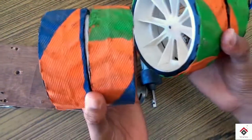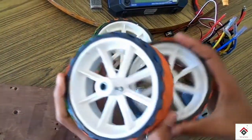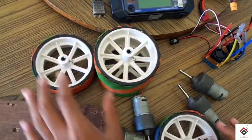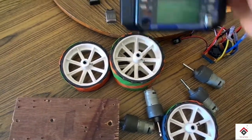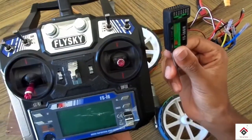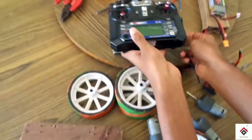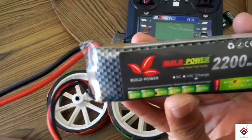For the wheels, we are using 10x4 cm plastic wheels, but if you want to participate in more off-roading challenges, just use RC car tire wheels. We'll also provide that link in the description. We are using a Flysky transmitter and receiver with a 2200 mAh lipo battery.